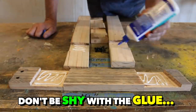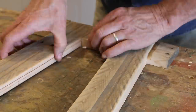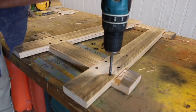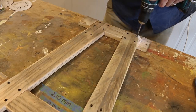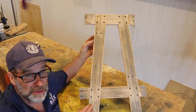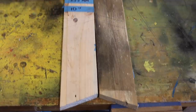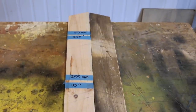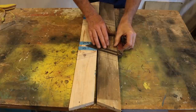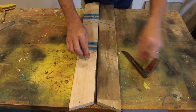If you're interested in following along with these projects, you can find all the tools I use in this video linked in the description box down below. Those back legs are all done and looking pretty good. Now all we need to do is go back to those front two legs to cut the step rebates in. These are the front legs, and I've marked out the rebates on the front two legs for our steps. The angle for our step rebate is the same as what we cut on the bottom and top of these front two legs.